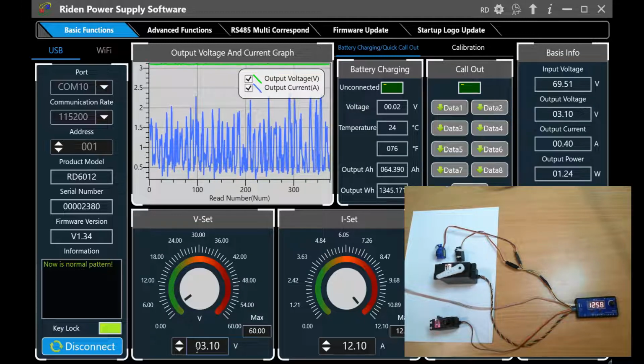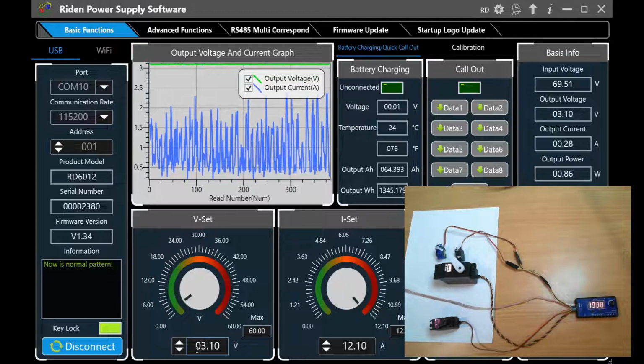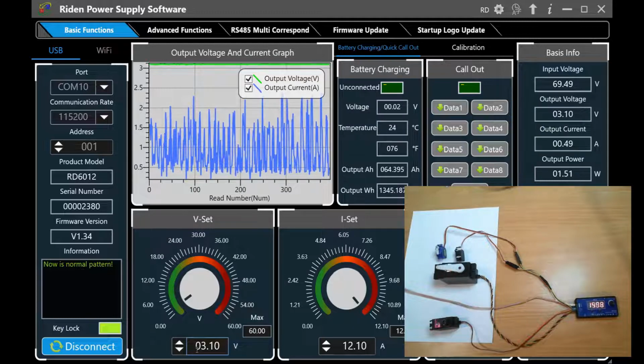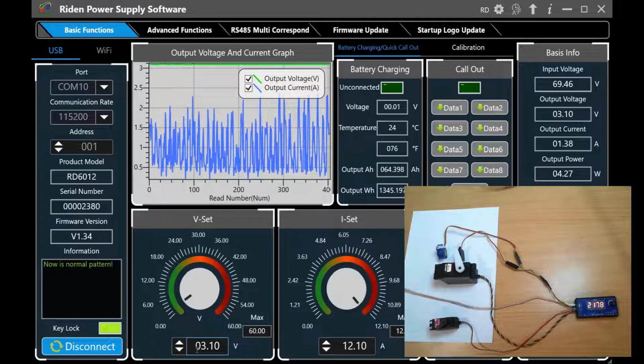So the problem with voltage drop in wiring is it can actually drop the voltage at the servos down below a threshold at which they do a self reset, and this is the borderline where the current in the servos can actually drop them down, and they will draw significant power on startup and do all sorts of weird and wonderful things, which results in them jumping and carrying on.